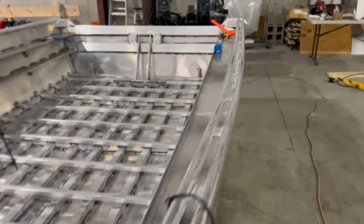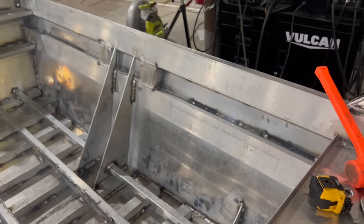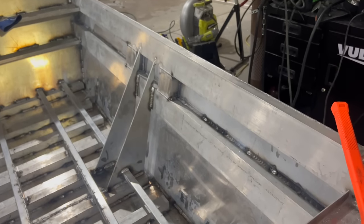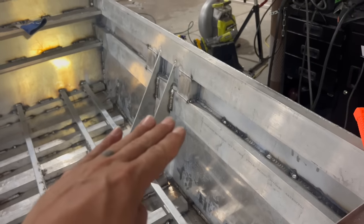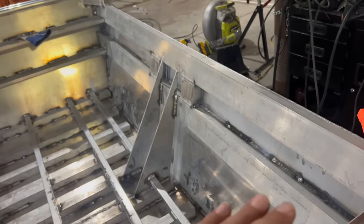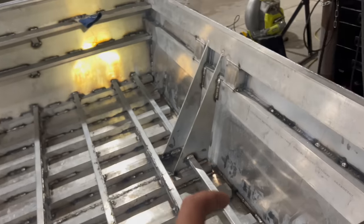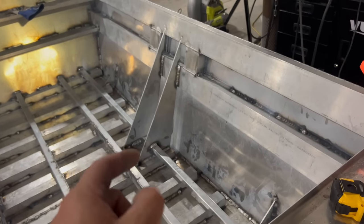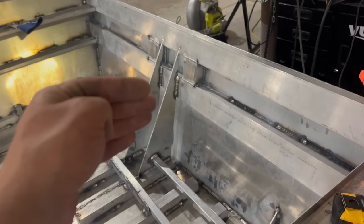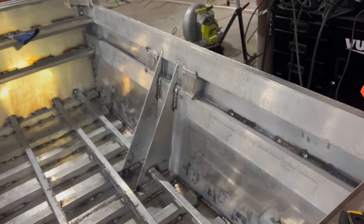Now to the back of the boat. Time to go ahead and build our framework in. We're going to have basically a shelf sitting out from the bottom of this 2x4 tube, and that's going to run across probably the whole length. I've got to hide the back of the boat a little bit. So it's going to run out to this support here for this part, so we can fit a battery and a switch panel. And then the bilge pump can go down in between in the middle. So that'll case off and over, and then we'll just run it along the edge there, make a nice little shelf right here. So that's what I'm going to try to get done the rest of the day.